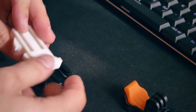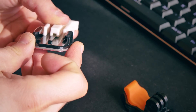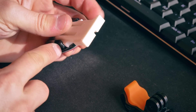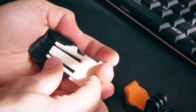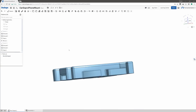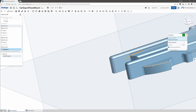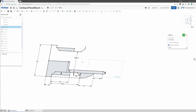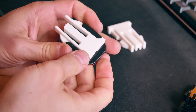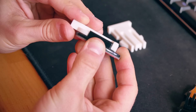This is what I love about 3D printing — you can draw something up, make a quick print (this was literally 45 minutes to print), and just see if it fits. See what changes you need to make. You don't need to worry about getting it perfect the first time because it's so cheap and fast — just prototype it and go through an iterative design approach. In this case it's pretty close, but it's a bit snug. The wings on the side are a bit too tall so I go back and make those a bit slimmer. I also widened the center channel for the center guide because it was binding a bit, and shortened up the added section in the center to make the flaps easier to press. The second iteration fits much more easily — the flaps are a bit too thin now, so I back off that correction a bit.